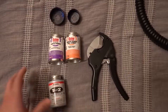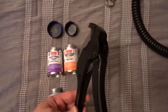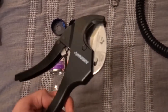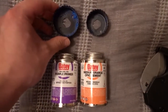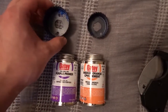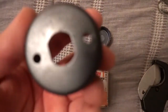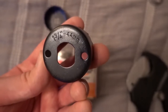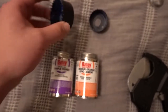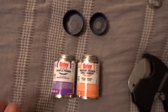The tools you'll need are as follows. These ratcheting PVC cutters are awesome for cutting both hose and PVC pipe. And then these hole saws are to cut holes in the barrel — you'll need two different sizes for the way I have this set up. The fitting size you'll need is one-and-three-fourths inch or 44 millimeters, and this fitting is two inches or 51 millimeters. So you'll need those two to cut the holes in the barrel.